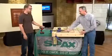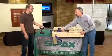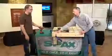What we have here is a typical application for a deck, either a joist or a girt to a 4x4. We do have it clamped for safety reasons. Typically this 4x4 would be in concrete. So what kind of screw do we need to use for this? Today on this application we're going to be using a Spax power lag.